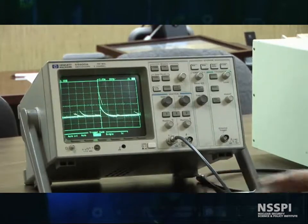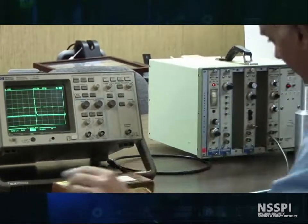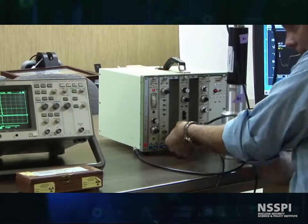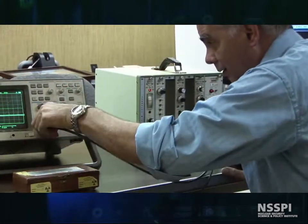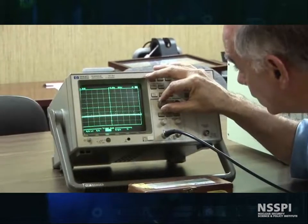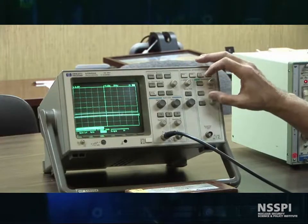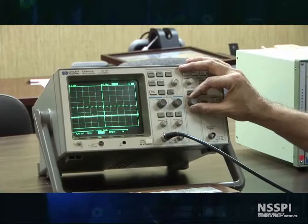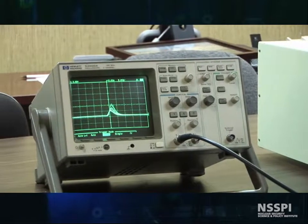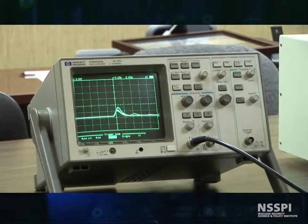From here, we're going to take our signal and go into our amplifier. And then we're going to take the output of our amplifier and see what it looks like. Oh my gosh, they're fast — and they're bigger. So I'm going to go up to a couple of volts. Let's change the level here. There they are. We're going to spread them out, and there's our gamma signals. It looks a whole lot like the same signal that came out of our BF3 tubes, and that's kind of the joy of NIM bins — they all look the same when it's said and done.